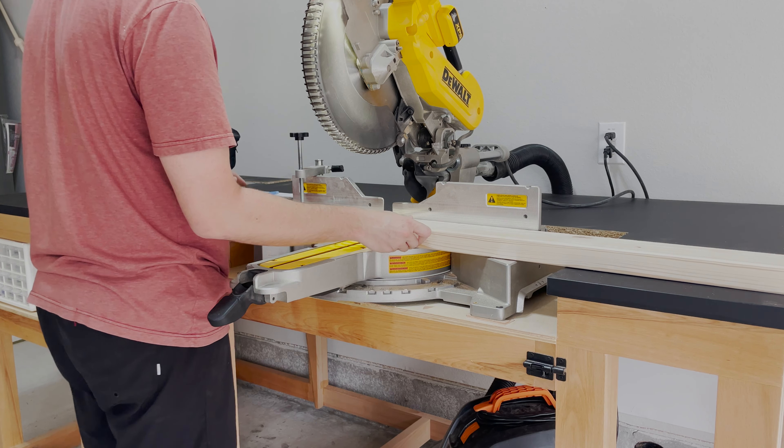These are 3-inch long screws. You can do shorter — you just want to make sure that you get at least an inch into the next board behind it. Now I'm grabbing the three-quarter-inch thick 2-foot by 4-foot plywood board. You can go thicker or thinner depending on your preference. I'm drilling an evenly spaced pattern around to make holes clean and round so I can install 1-and-1/4-inch long interior construction screws, placing them around the board so it's snugly fastened and secure.